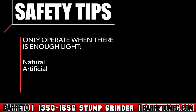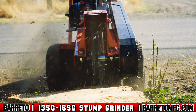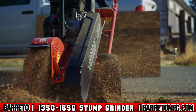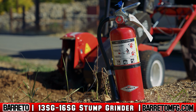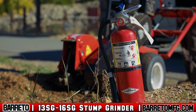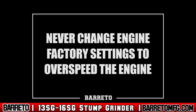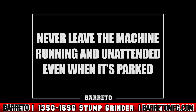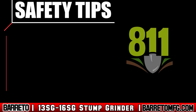Only operate where there is enough light, either natural or artificial, and allow for plenty of side and overhead clearance between the machine and buildings, fences, trees, and other obstacles. If grinding can't be performed with adequate clearance, use a barrier or guard to prevent flying debris. We recommend having a fire extinguisher suitable for petrol fires on hand whenever the machine is used. Never change engine factory settings to overspeed the engine, and never leave the machine running and unattended even when it's parked. Always call 811 before you grind.